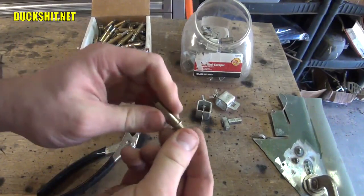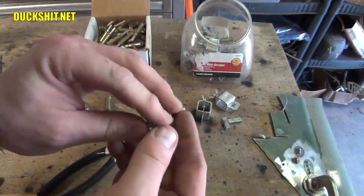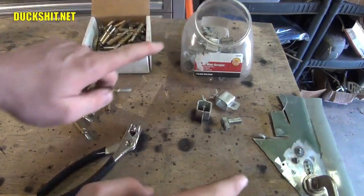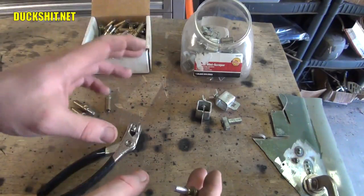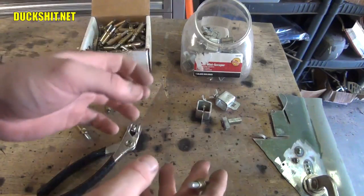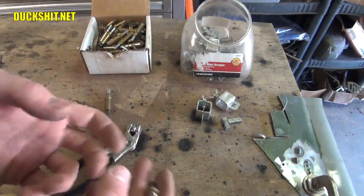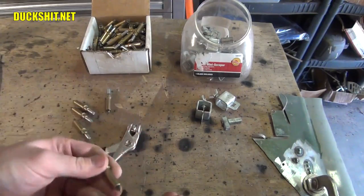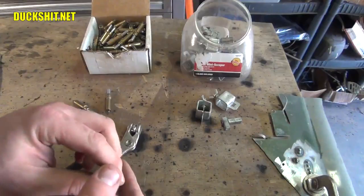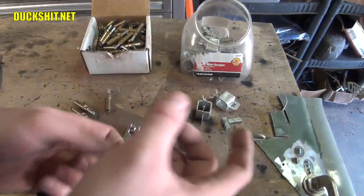These are very awesome rivets — quickly and easily removable. If you need to move your panel around for some reason, you haven't made your cuts yet and haven't committed, I like to use maybe 3 or 4 Clecos depending upon the size of the panel, drill holes around the outside area and lock a few in place. Not only do I take measurements, but sometimes I'll eyeball the situation, because even though your measurements might be accurate, the car may not look right. It may not be the most appealing shape. When I built Eleanor, a lot of the measurements were off and I had to eyeball it. You can put these in there, adjust things with your eyes before you make any of the final cuts and do that final weld — because once you've welded, there's really no going back.